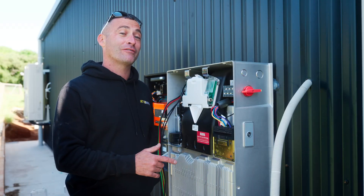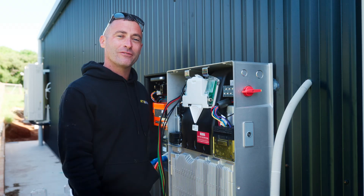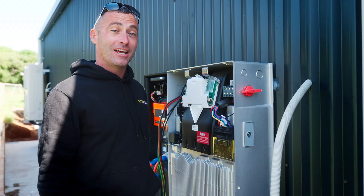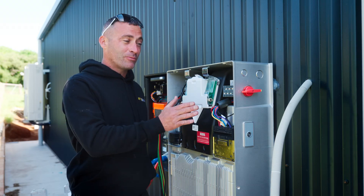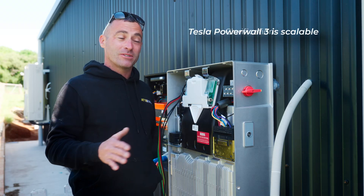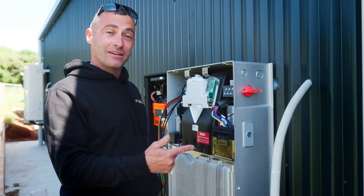This is a 13.5 kilowatt hour battery — the same as the Powerwall 2. But the main difference is the Powerwall 3 can discharge up to 10 kilowatts at once straight into your house. That is a lot of power. We can also stack multiple units, multiplying the storage by 13.5 kilowatt hours — up to 4 to 6 units. This battery can also AC couple and DC couple.